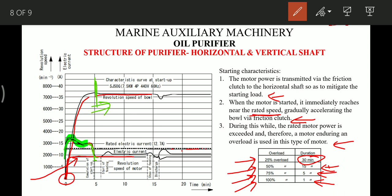When the bowl RPM is reached, once feed is given, the current increases slightly. When feed gets stabilized, the current decreases a little, then increases again. When feed is stopped for the desludge operation, the current first decreases, then increases after the desludge operation is done. The purifier bowl RPM also decreases during desludge due to loss of momentum, and the motor speed decreases similarly. This is the cycle represented by the graph — it is very important to understand it as it helps troubleshoot problems with the purifier.